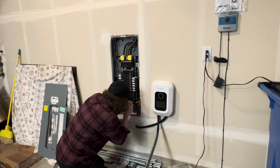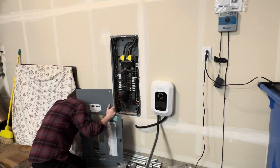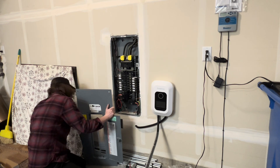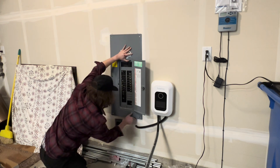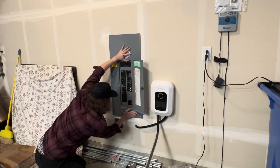I took the hot wire and landed the black wire first onto the breaker. Mine was labeled 'N' but I confirmed with the manufacturer that it was a hot because it is 240V — I just wanted to double check. Then I landed the red wire on the breaker and popped out the two spots for the new breaker so I could put the panel cover back on.